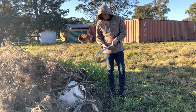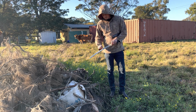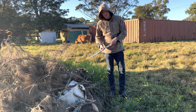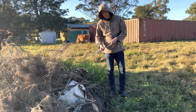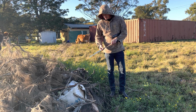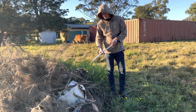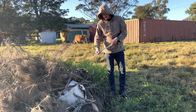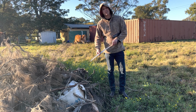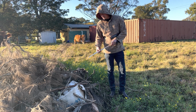grind. From the top of the bevel back towards the spine, there's a very slight hollow grind to it, which is fine. And then from the primary bevel forward, it's kind of a hollow grind followed by a convex final cutting edge. I believe that if I were to change that hollow grind into more of a flat grind, that would make it a little more efficient at chopping wood rather than applications as a weapon.